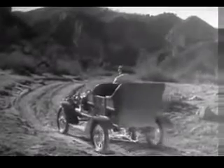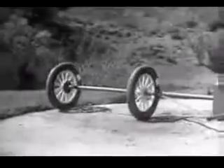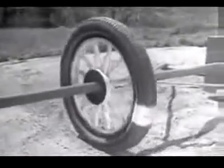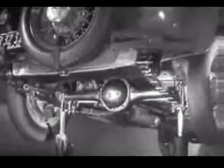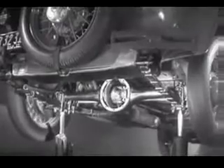By the engine, it had to do all the work, and it couldn't get a good enough grip on the road to do its job properly. So the one-wheel drive was soon out of date. But if two wheels are locked on an axle so that they are not free to turn separately, one or the other has to slide. So engineers had to find a way to connect both rear wheels to the engine without sliding and slipping on turns. The device which makes this possible is a part of the rear axle. It is called the differential because it can drive the rear wheels at different speeds.